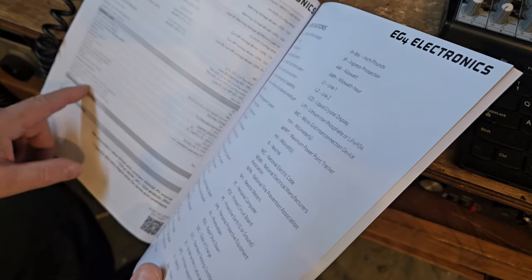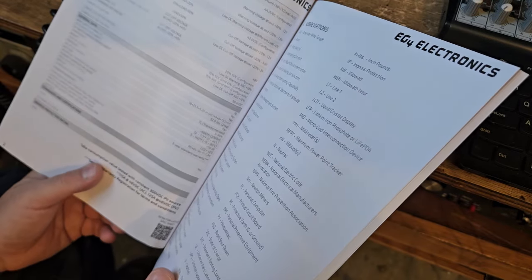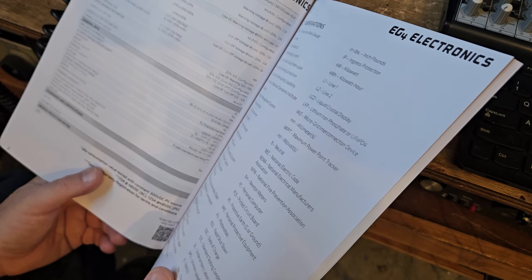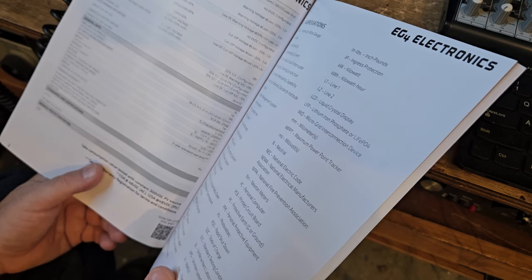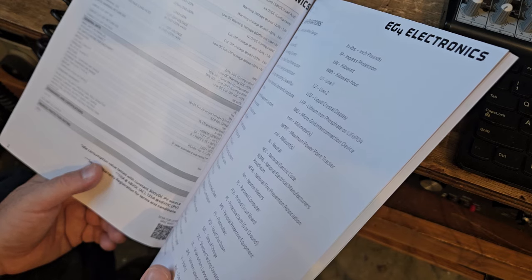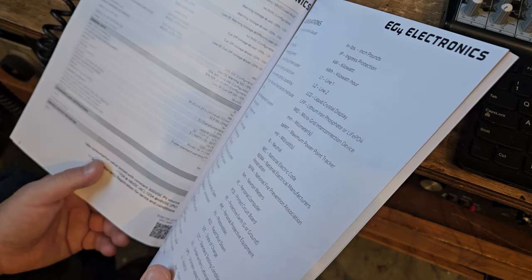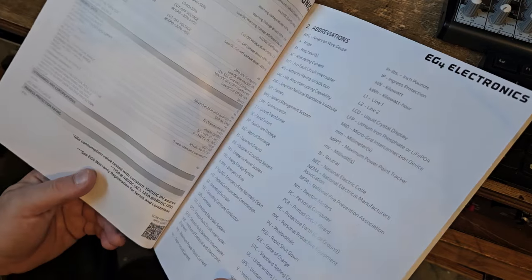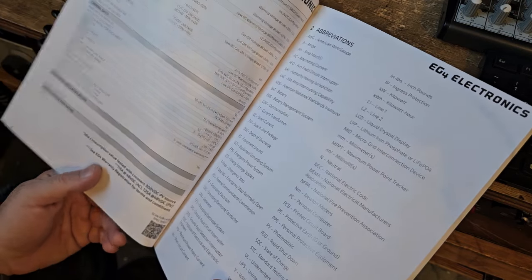Standard 5-year warranty. PV reverse polarity protection, pole sensitivity, leaking current monitoring unit. Surge protection device, output over voltage protection, varistor, yes. Certifications, UL 1741, FCC Part 15, Class B.